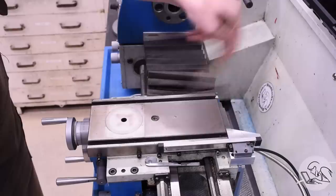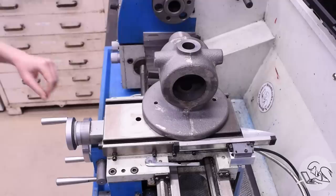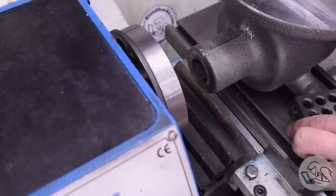I've decided to try this on the lathe with a cross slide setup similar to the line boring operation that I did on my big steam engine. The bore on this casting is not big enough to do a line bore though — I think the line boring tool would end up too thin and not rigid enough. So it's going to be a traditional bore, but I am going to fixture on the cross slide. The obvious way to set this up would be using the bolt holes in the base, but unfortunately that puts the nose on the casting much too high for the spindle nose on my lathe, so we're going to have to do this upside down. Since we've faced the top of that boss parallel to the base, this is just as good a reference.